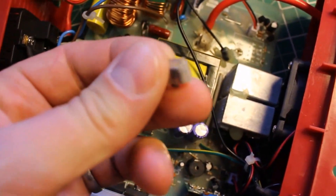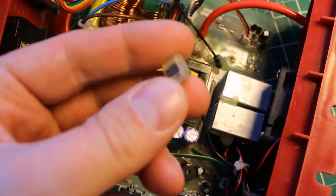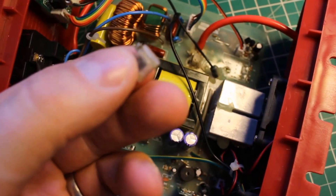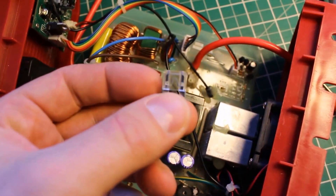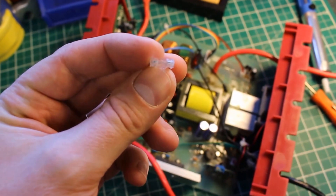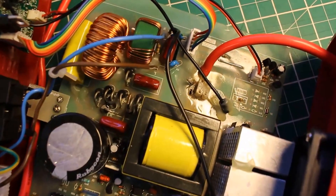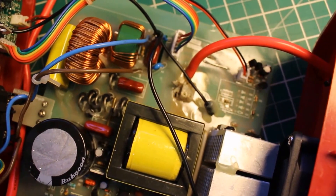You can actually see one of these here — I'll just bring that to the camera. Despite Sterling being really unhelpful in sharing any technical information, I did find out that these are in fact mini blade fuses — the same common type anyone who's replaced a fuse in a car recently would recognise. This is a 25-amp example, and there are three of them, making 75 amps in total. I'll get those changed out, which will be a solder job, and hopefully we'll see how it all works.